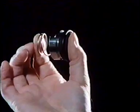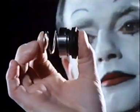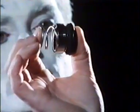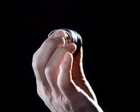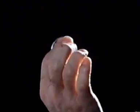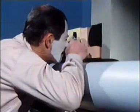The sealing effect is either 100%, but then the seal faces will run dry and wear, or there's a lubricating film between the seal faces and minimal leakage will be unavoidable. But then a seal with a very low leakage rate will offer long service life and utmost reliability. This means the lubricating film is indispensable for the performance of a mechanical seal.